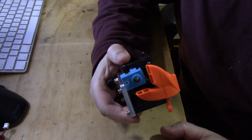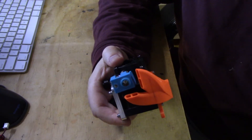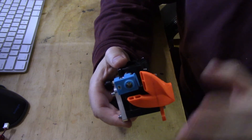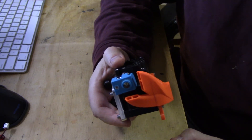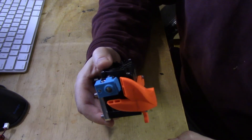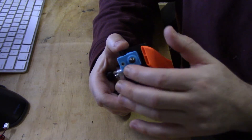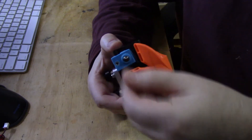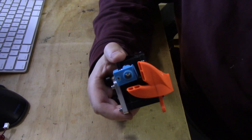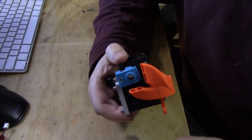That flooding you really don't need. If it's installed correctly and everything's built correctly, this should cool your parts quite nicely — it does mine. That's the whole reason behind it. I like it, it works well. It's up to you — use it, don't use it, flip your block backwards or don't. There are a couple of people that have it turned to 45 degrees — that works too. Whatever makes your Hemera print and keeps you happy works. I like this design, it works well for me. Thank you.